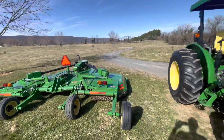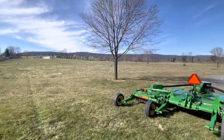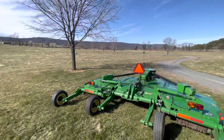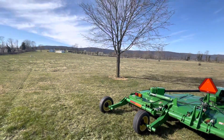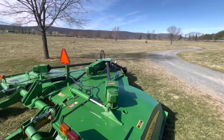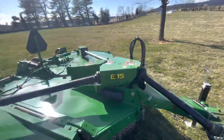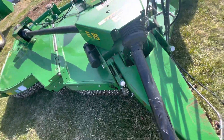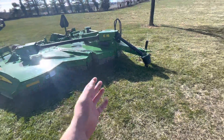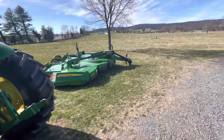To be honest, for the 85 horsepower this tractor has, that batwing is way too much. When we get up to the hill here, this thing absolutely cannot pull it. You have to do little laps and go around the back of the property where it's flatter just to pull the batwing, which is super annoying. The batwing is a pretty good rotary cutter except this shield broke off, and it might only have 85 to 100 hours on it. It's the E version, so I guess that's what you can expect — John Deere's quality the last few years is just mind-boggling.